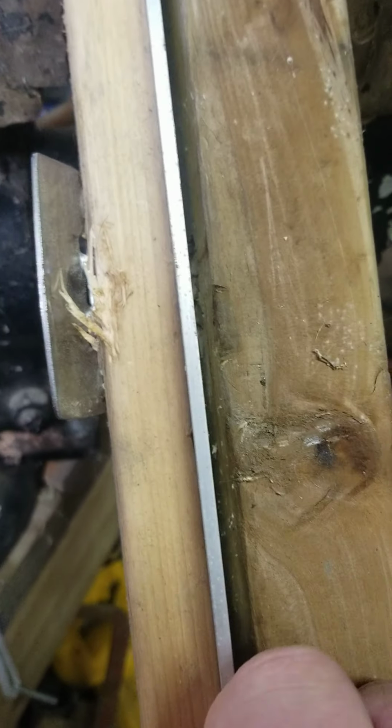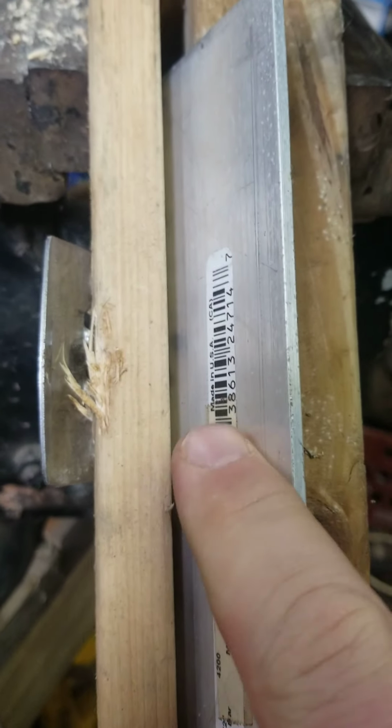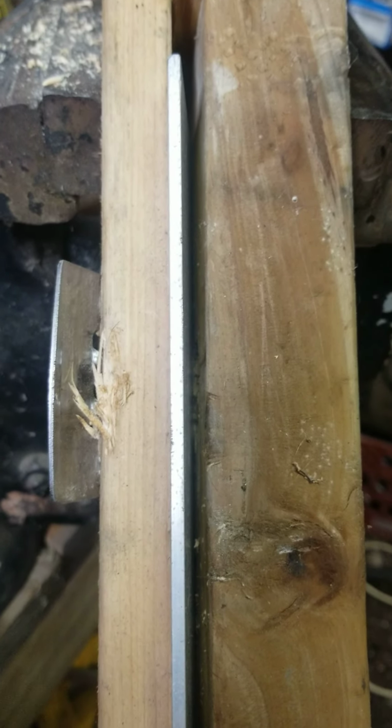Well, these shims are usually put into doors. You can do so a couple ways. You could find a bar of steel, which is going to require some specialty drill bits, and you would place said steel back here, but you want to have it the correct width so it fills the whole gap. Pre-drill your hole here. This is a piece of aluminum, but if you were going to put this back in between your door frame, you'd want to use steel.